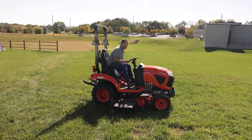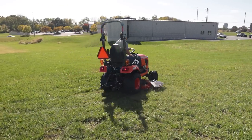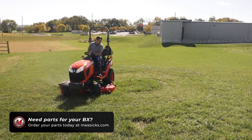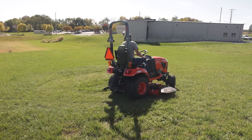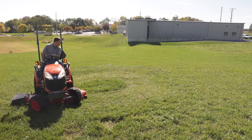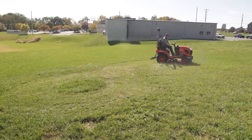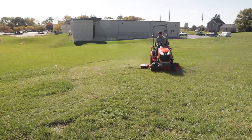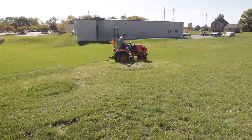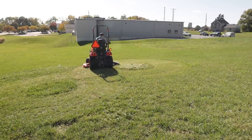We're going to repeat the test the other guys did. Remember, Tim was at 78 inches, Brian at right about 60. So we're taking our tractor in two-wheel drive, putting it to full lock, and doing our donut to see our uncut circle of grass. We're also going to do this going in both directions - left and right - in two-wheel drive. I'm basically cutting right down against the ground to get as defined a result as possible, scalping as we go.